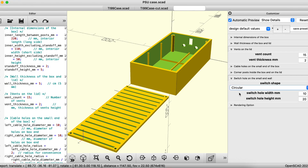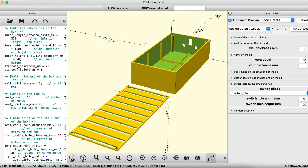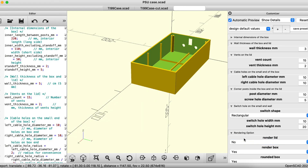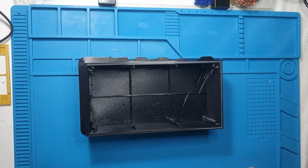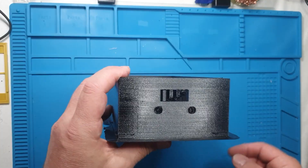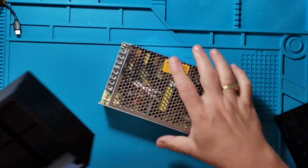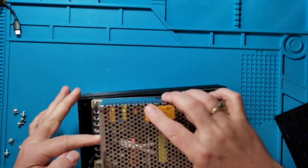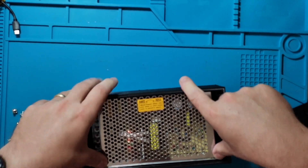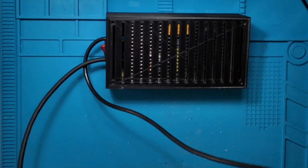They teach you patience. I've produced a power supply box designer in OpenSCAD. You can specify the size of the box and how big you want the cable holes and switch holes to be. I've used it to create this enclosure, in which I have placed the triple voltage Mean Well power supply. While I've used PLA to print the computer case, I've used nylon to print the PSU case. Although I'm not expecting it to get very hot, PLA can warp over time even on a gentle heat, so using nylon should mitigate this. I've also used a 4-pin XLR plug and socket to allow the power supply to be removed from the computer.